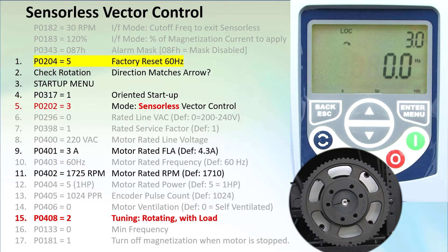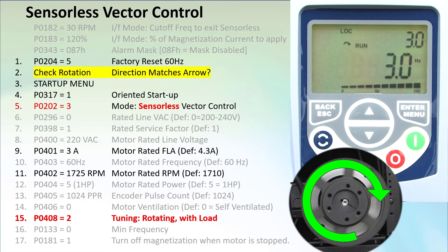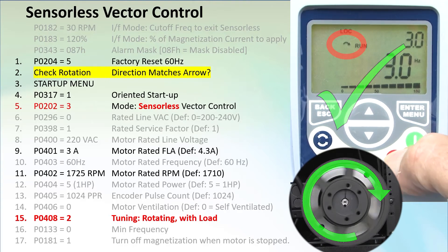I reset this drive to factory default before starting the video — if we did it again right now, we'd have to disable that encoder fault bit in parameter 343 again, so let's not do that. The drive defaults to volts-hertz mode, so hitting run spins it up to its default 3 Hz minimum frequency. Verify that the motor is spinning in the same direction as its arrow on the display. If not, remove power, swap any two motor leads, and try again. Ours looks good, so I'll hit stop.